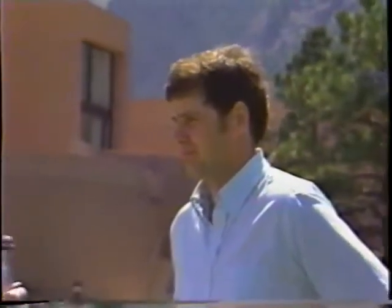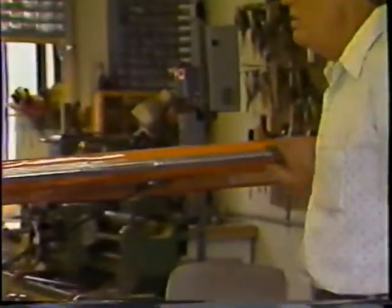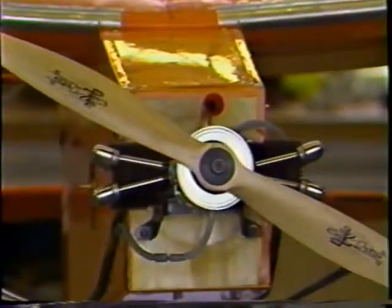I see. And obviously it will have some technical instrumentation that you don't find on many model airplanes out at the local field. Do you have any telemetry or feedback on what the airplane is going to be doing? Yes, we'll have to transmit back parameters such as relative humidity, temperature, pressure, probably relative airspeed, and in addition we hope to transmit back engine temperature and RPMs and so forth, so that we can keep track of battery condition, and we can make this system operate in a simple, reliable way.